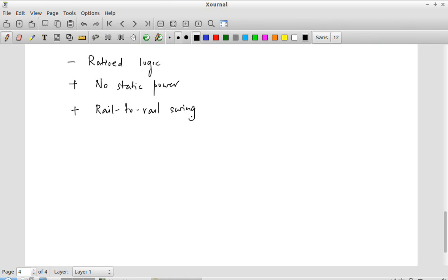Correct. So, if you are trying to build a more complex circuit where you want the output and output complement, one example is that decoder structure that we talked about. Remember where we assume that both A and A bar were present? If I want both the output and output bar to be present, very often I can find that the logic which I need can be reduced if both out and out bar are present first. Otherwise, I can still realize the same logic, but I will need an extra inverter.